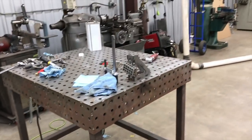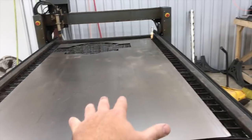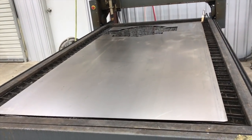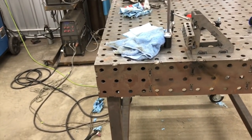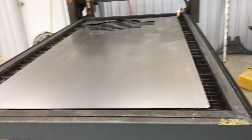This is the prepping yesterday for the paint, getting everything cleaned off. I found a couple things. One is I was wiping all the oil off of these sheets before I would do the cutting, because it's just easier to clean in a flat sheet before you have it all cut up. And also the shop towels, or even just a regular towel, like Shut Your Face Garage sent to me here, want to grab on the edges and leave little fuzz. That can cause a problem later in the paint. You'll get that fuzz into the paint if you're not careful.